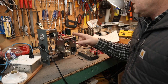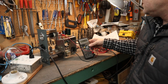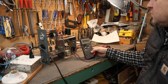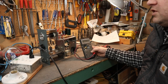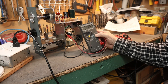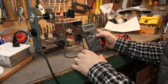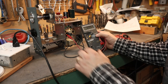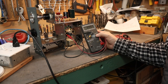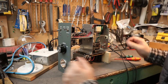B+ is up to 276 volts. I put the voltmeter on the other side of the OD3 tube and it's reading 148.5 volts - right around 150 volts - so that's pretty steady. The OD3 tube is functioning as it should and we don't have a dead short, so that's good. Let's measure the heater supply - the DC filament supply is topping out at about 6.1 volts. Anywhere between 6.1 and 6.3 is suitable; we don't want to go higher than 6.3. I have a dropping resistor of 0.75 ohm in there. Let's see how it sounds!